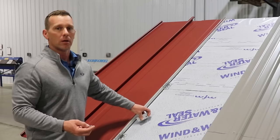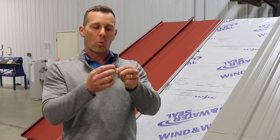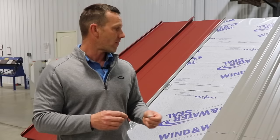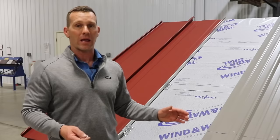Why is that an important feature? The only thing that stops water from getting into your structure with corrugated metal is a little rubber washer — a neoprene washer. In the Midwest, southern Indiana and northern Kentucky, we find these washers go bad somewhere between year 9 and 12, causing leaks around the screws. With standing seam, you don't have that problem because there are no exposed fasteners. Exposed fastener versus hidden fastener is difference number one, and it's a major difference.